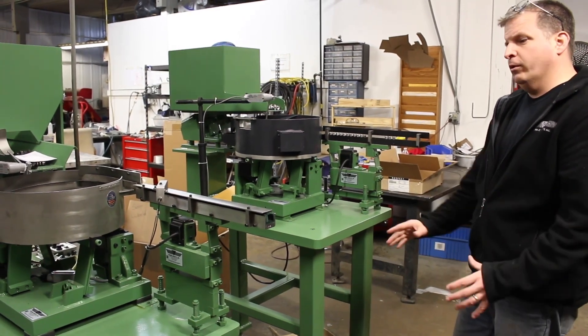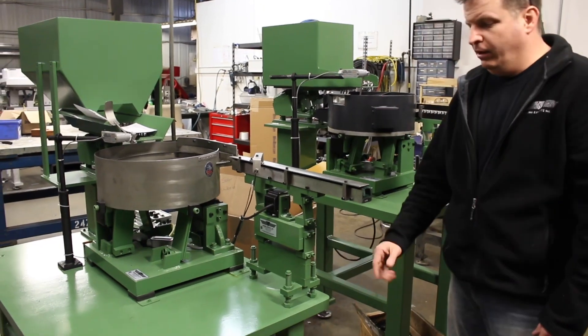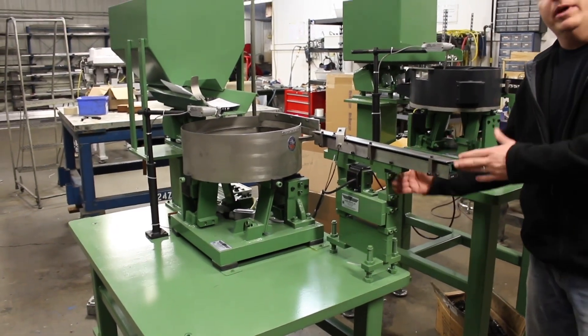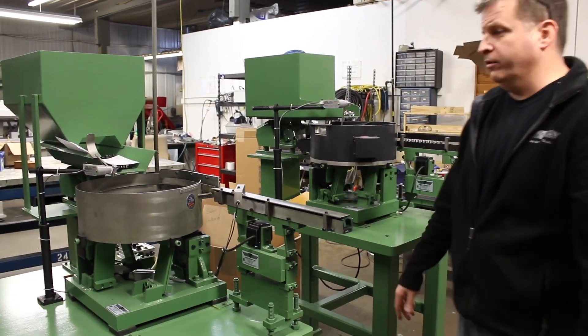When you're ordering feeder bowls, the key dimension really is going to be from the edge of this plate up to the running surface of this part from the ground, over from the edge of the plate and your overhang. Those are the key dimensions because you really don't care what's going on inside this machine, as long as we stay within the boundaries of it.